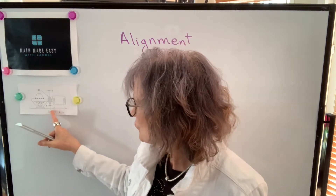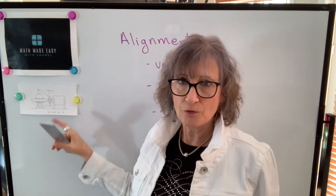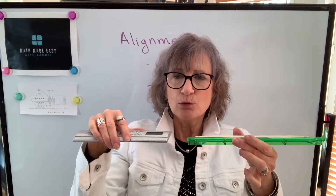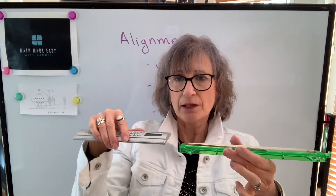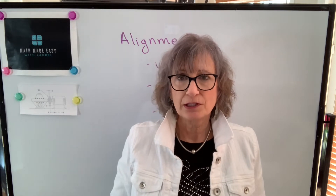In this case, we would be putting shims under the front or the back feet or all feet. If we were to do horizontal alignment, it would just be shifting the machine back and forth, or shifting the back legs or the front legs, depending on the angle. All we're going to focus on here is vertical alignment.